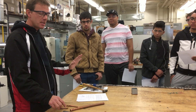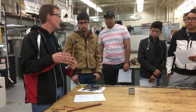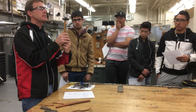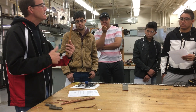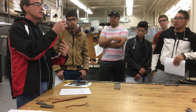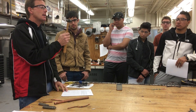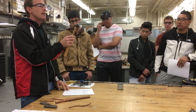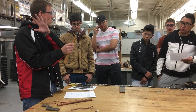One way is just going to be today, using these tools called punches. You'll also need — notice on the right-hand side of the locker — these ball-peen hammers. We use it because it's got this ball on one side that acts like a weight, and they come in sizes usually like 8, 16, 32 ounce, measured in ounces. The weight of the head determines the size of the hammer we're going to use. This here is just a standard 16-ounce ball-peen hammer, and that's all we're going to use here.